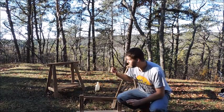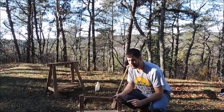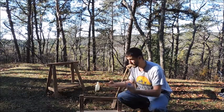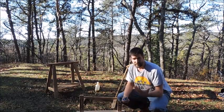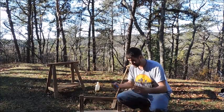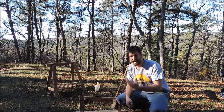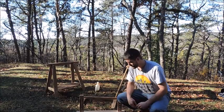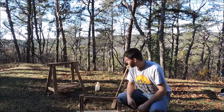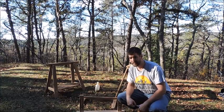But just a note on the vinegar, I'm not going to do my tabletop in vinegar because not only do I want to get a couple different looks in here, but the vinegar is acidic, and obviously if you're using a drafting table, you don't want to introduce acid into your paper and prematurely yellow it, so just a consideration. But with that said, I'm going to let these dry and we'll get into the blowtorching of the tabletop.